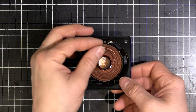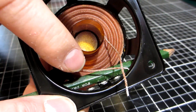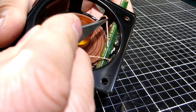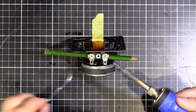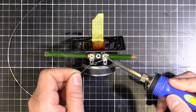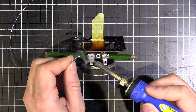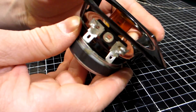Now we have to join these wires to our speaker terminals. We put a pencil through here and that holds the wires up while we solder them, so they don't loop down onto the spider and stay up out of the way. There we go, all soldered up.